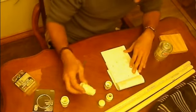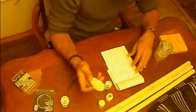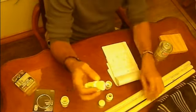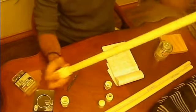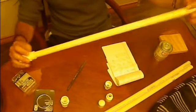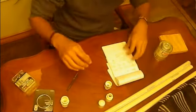So then what I figured out after I knew the additional length that each of these would add, the top was going to have a female and a plug and nothing else. So there was going to be an additional 1.5 inches. So top length altogether with the plug and the female adapter totals out at 24 inches, which is what I was looking for.